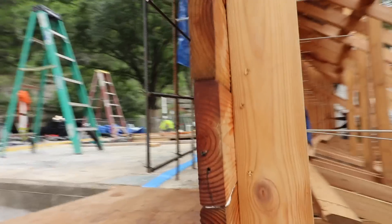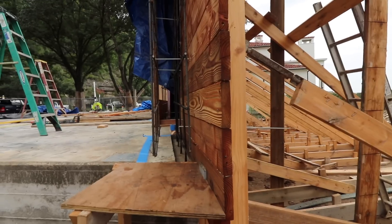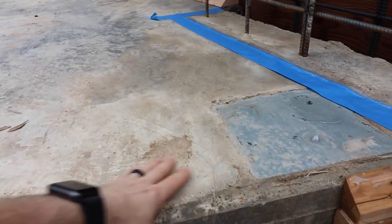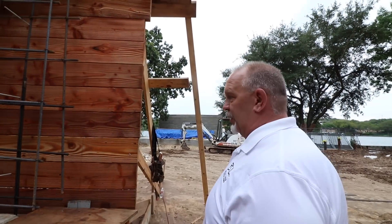If you didn't have that silicone keeping the water in, you'd be worried you'd get too dry of a mix. All your water comes out and it literally leaves a sand residue in the back. When that happens, you won't get the finish that looks like that — it's going to look horrible. Chris's attention to detail is second to none, but he could teach a lot of guys this. We've poured quite a few projects with Chris and he's an amazing concrete guy. Even attention to detail with blue tape on the concrete — he's blue-taping that and siliconing it too. So that blue tape sticks there, and when he puts his inside form board, the concrete hits that. He can pull that blue tape and then if this inside slab is a finished slab, he's not going to have a bunch of nasty stuff on it. Luckily for us, none of the concrete shows except the board form out here — everything else is getting covered.